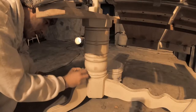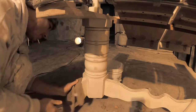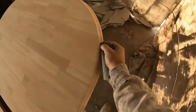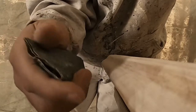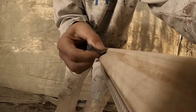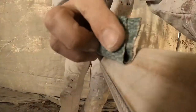First step was to sand down the table. I'm using a deglosser — TSP, trisodium phosphate — it's a surfactant that roughs up the existing paint and cleans off any grease or residue. I can't sand the edges by machine because I use the palm sander only on flat surfaces. If I tried to use the palm sander on the contoured edges of the table, it would totally ruin the shape.